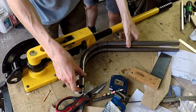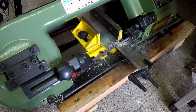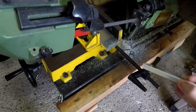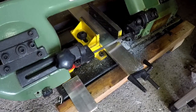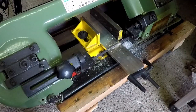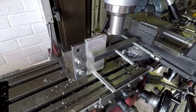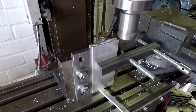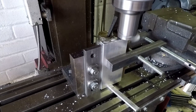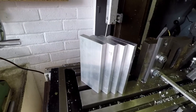So two nicely bent handlebars. Now I'm on to making the aluminium uprights that are going to support the handlebars, so back to the band saw — I need four of these. Over to the milling machine and I'm facing the ends of these bits of rectangular section bar using my fly cutter, so they all end up exactly the same length.